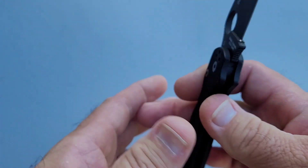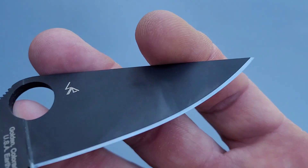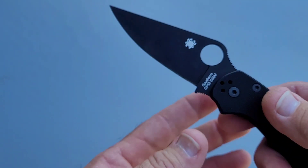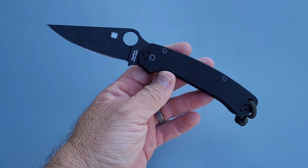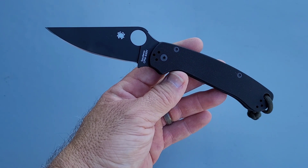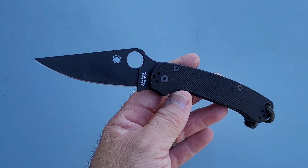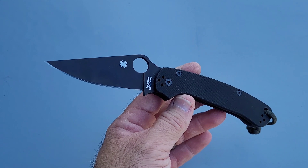Most of the wear went away on the side I cleaned up, and this side I didn't touch yet. You can see the different spots where it still has cardboard residue. Like I said, sharpened it the first time and ran that test — 115 feet fine edge, 89 feet working edge, for a total of 204 feet. And in just one sharpening, that was a 167 foot increase in the same one inch section.